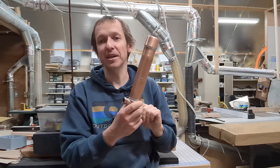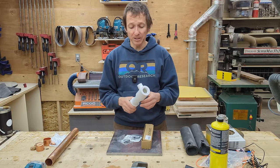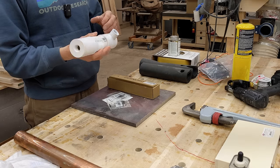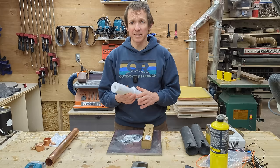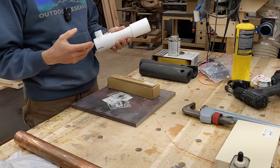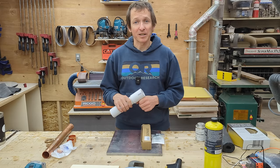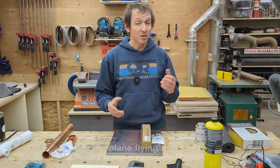The very first prototype I built was out of PVC — working with PVC is way faster, but as you can see in boiling water, even PVC softens up quite a bit. My big concern with the PVC version is that if the heating element stayed on with no water to buffer the temperature, this thing could eventually melt — a real catastrophic scenario. That is why I wanted to go with a copper design for my own van. I am terrible at soldering, but it's a non-pressure situation — using a foot pump, this thing doesn't have to hold any pressure, just needs to be watertight.